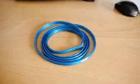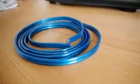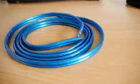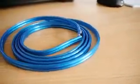Now it's time to add the wires for the LEDs. You'll need two lengths of thick paired wire, each about one metre long. They need to be thick so that they can supply the current needed by the LEDs — I recommend at least 12 American wire gauge wire. After stripping off about 16cm of insulation from one end, drill two holes on each side of the panel and thread them through, making sure the stripped ends are on the front side. Position them splaying outwards from the centre and use staples to keep them in place. Each side is going to have its own polarity, so it doesn't matter if they touch at the middle point.